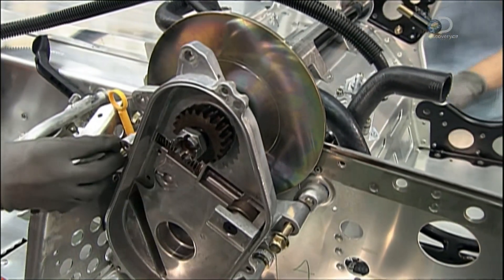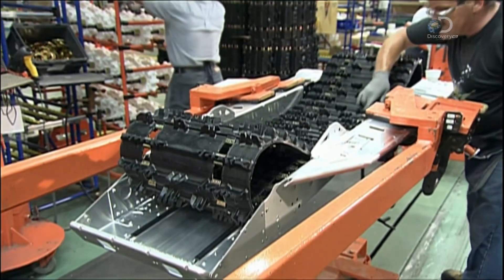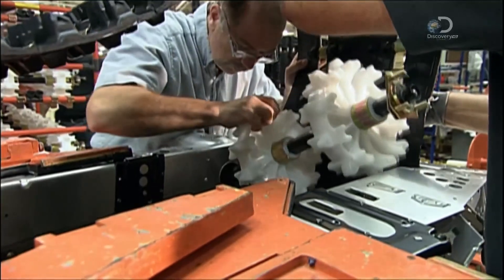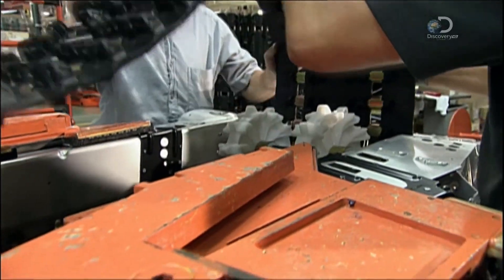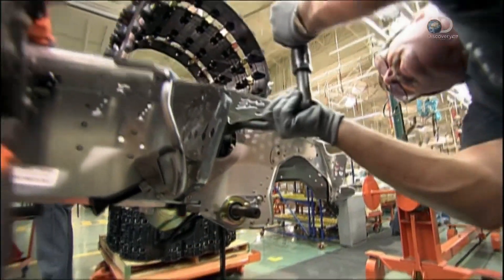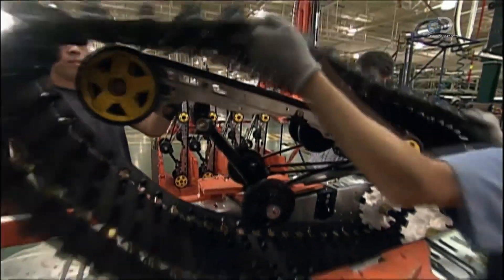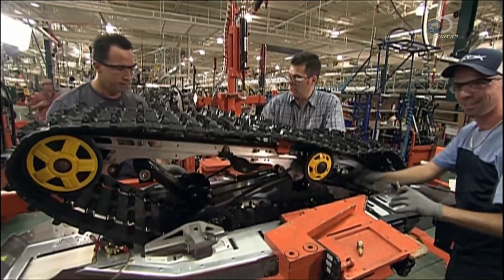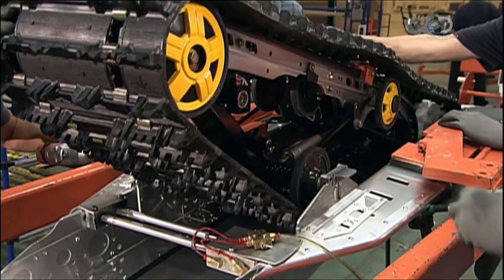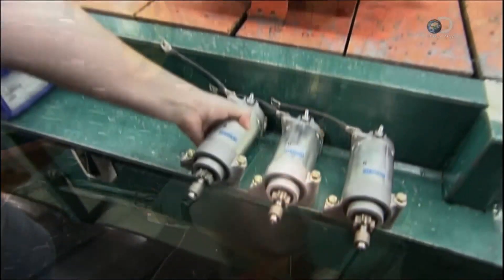The transmission fits on top of the frame. These coils, springs, runners and wheels fit easily into the rubber track. The rear suspension system connects to the track system, while this white plastic sprocket connects the track to the transmission. The speed sensor attaches directly to the sprocket. Four high-grade steel bolts anchor the rear suspension system to the frame — they're so strong that the suspension can withstand the vibrations that come with high speeds.